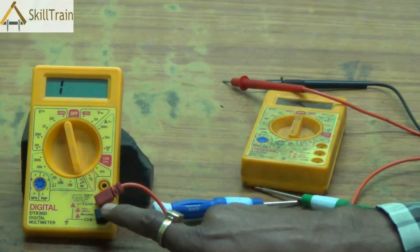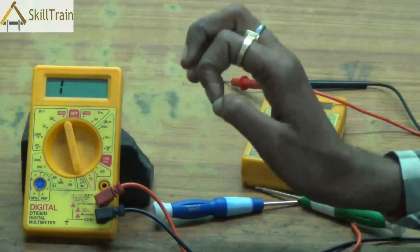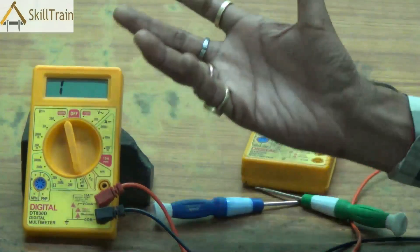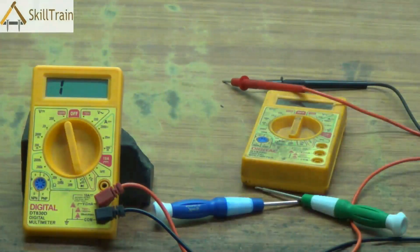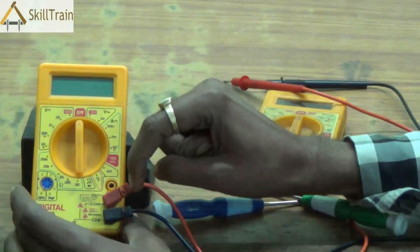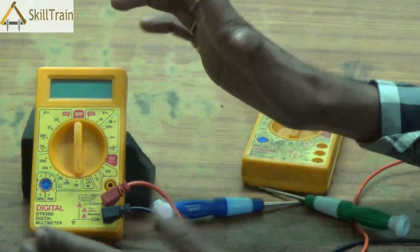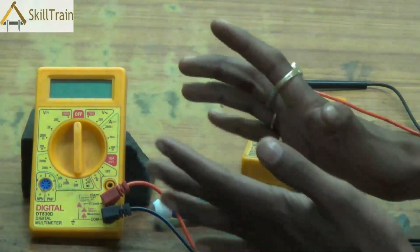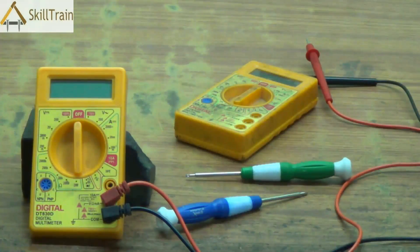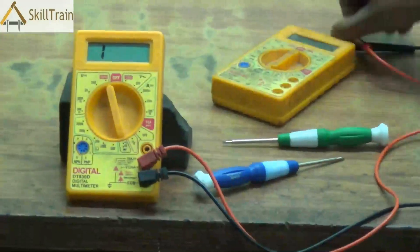You must be aware that there are two probes in a multimeter. Most often, problems usually arise in the probes, because this is the most commonly used part of a multimeter. The main problem is when we pull these probes out, the wires inside could snap, resulting in an open circuit, which means the connection is not complete. That could be the biggest problem.